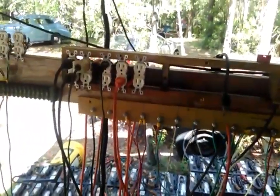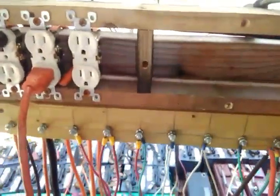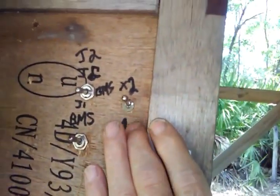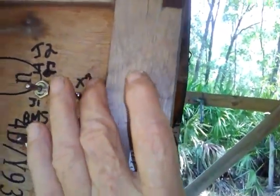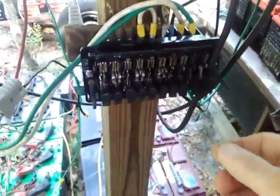So what I'm using now — outlets are very cheap. I think they were 50 cents a piece, and finding old cords is easy. What I've done is I still have my panels set up so I can hook them into either a 48 volt group or a 96 volt group, depending on which way I flick that one switch, which I have to flick off of a load. I've got my switch right here that turns everything off from the panels to the batteries.